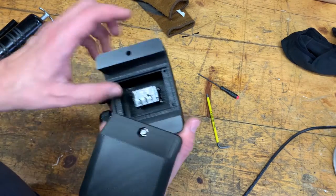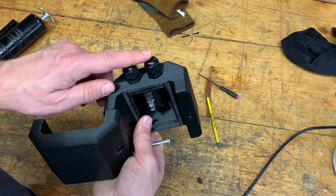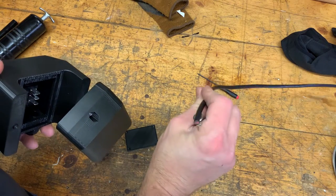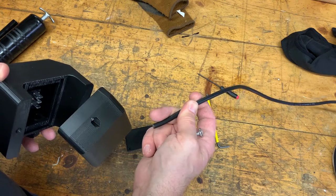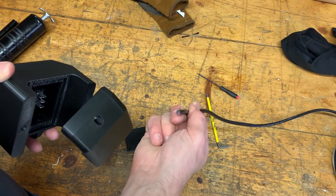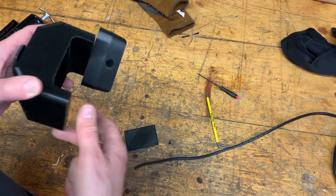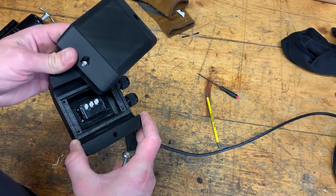It's open on the inside, and I've got two cable glands coming out of the bottom. To wire this up I'm going to use this vinyl-jacketed wire out to the motor. I only need two conductors — 12 volts coming in and 12 volts going out with reversed polarity. I just realized right now that I accidentally ordered the wrong switch.